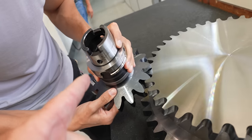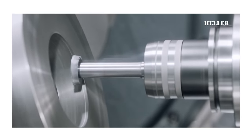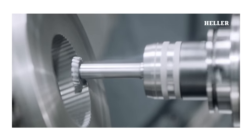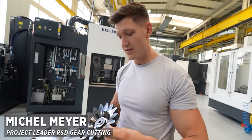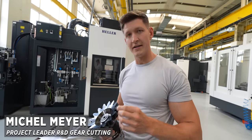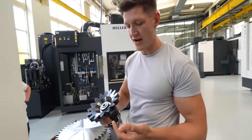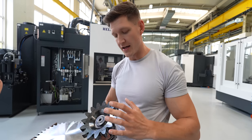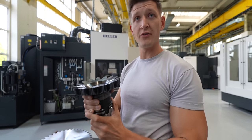When you look at the tool it rotates perfectly and fast — this tool is spinning much faster than the workpiece. The workpiece has a much bigger diameter, they're just in sync, and it just cuts and cuts until the gears come out absolutely perfect. The tool has a specific shape designed for the specific part. When the tool wears and reaches the end of its lifetime, you can just re-grind the rake face and reuse it like a new tool.